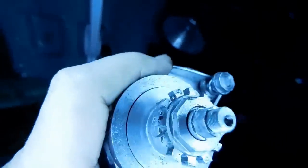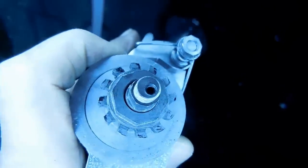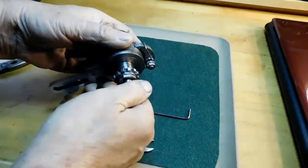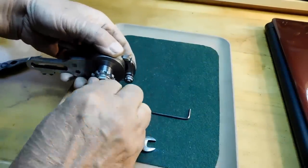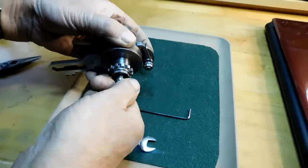And there it is, just as it comes off the lathe. You can see the form relief on the back of each one of the teeth. So let's go ahead and take this upstairs, and I'll take it apart and show you each of the individual pieces. This is the nut that holds the indexing sleeve on. It's 40 TPI, and it's a rather shallow thread.